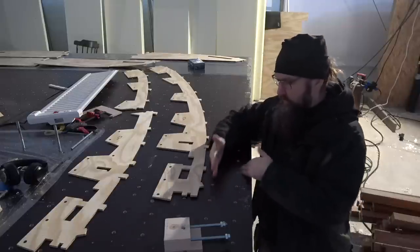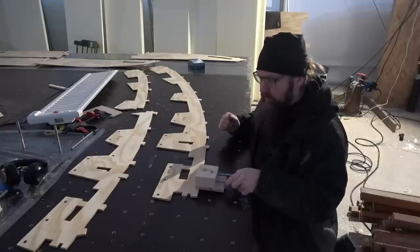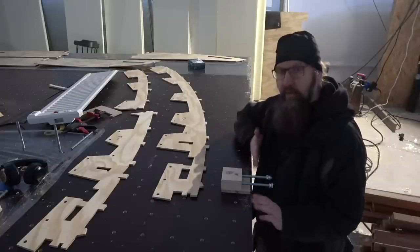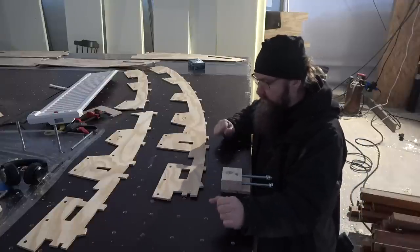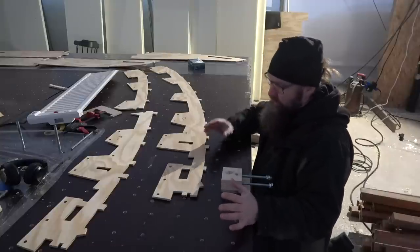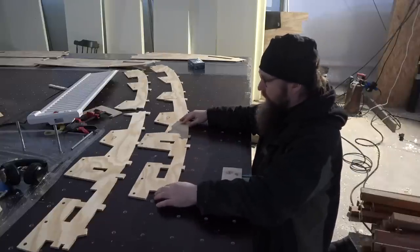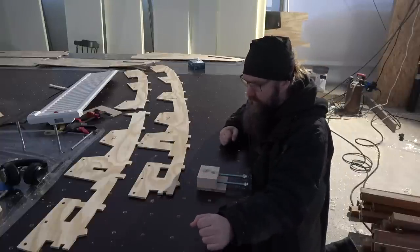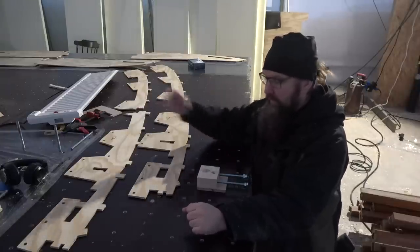And you can see that there's only two rows of these holes left, and this clamp doesn't really fit on that second row, so it has to be on the outer row like that. And now the box doesn't fit on the table anymore, and that's a problem because we need the box, of course, to be well around here to make the epoxy cure. So that's the second reason I'm doing these in sections, is that I can place this not on the center, but one row that way. And now the clamp fits right there, but I cannot do the second side at the same time.